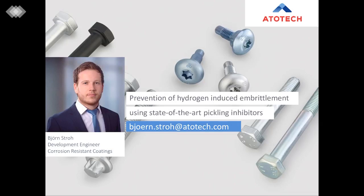Next question. Can the pickling inhibitor be analyzed? So there is a possibility to analyze this inhibitor, but this requires quite sophisticated analyzers. So it should not be used as a tool for the bath control.